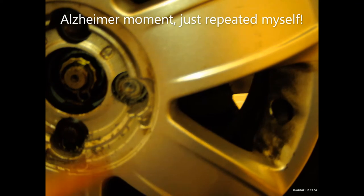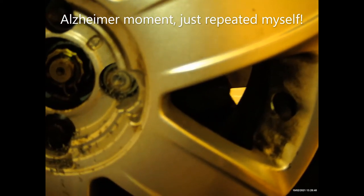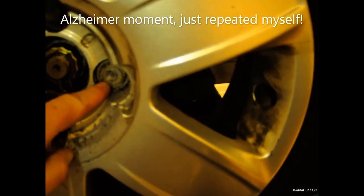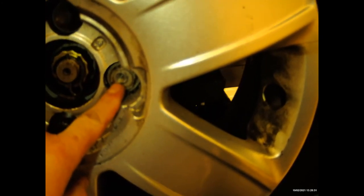Once I've got it off I can use a spline — slightly oversized FBH, that's known as a big hammer, I'll let you work out what the F is — knock it in and hopefully we should be able to turn it. I've gone off centre which might be a problem. Try and get dead centre if you can, but hand and eye coordination with the centre punch is not the best thing in the world.